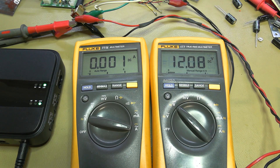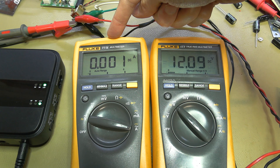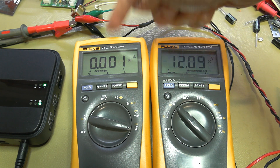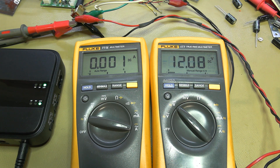I've got the output voltage and current draw on the meter, set to the 10 amp DC range, with the output hooked up to a DC load. Winding up the load — at 200 milliamps it's still holding strong at 12 volts. Taking it all the way to half an amp, it's still looking fairly good, measuring directly on the output after that 1.2 meter lead.